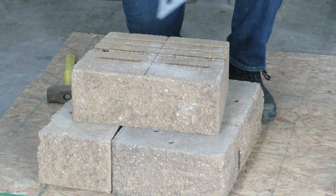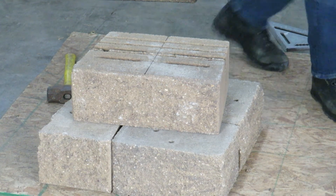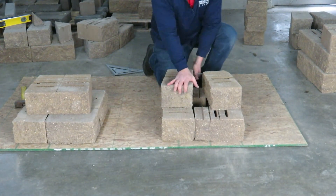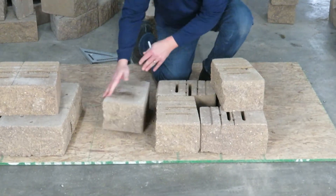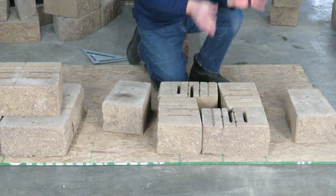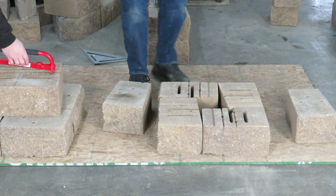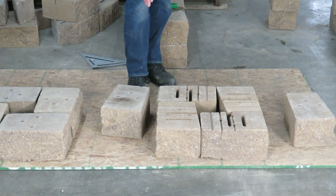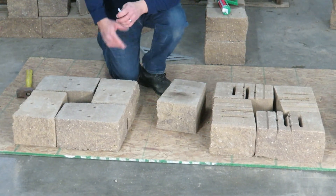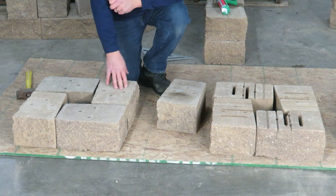We've already got half units laid out. A good tip of the trade is once you've split the block, take and flip it upside down, separating out the lefts from the rights and making stacks of columns — right hand sides and left hand sides. Here you can see the difference between having the block right side up and upside down, where the grooves on the top show. By flipping them upside down it'll significantly hide those grooves.